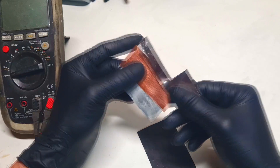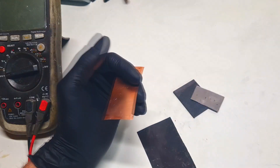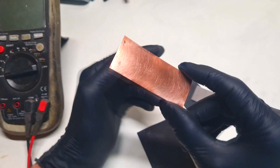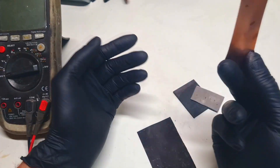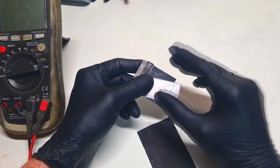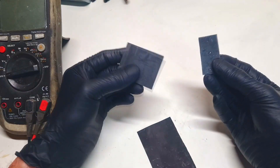Because if your battery uses a strong acid, like sulfuric acid for example, then you will not put copper or aluminum-based current collectors, because the electrolyte will eat away the current collector. So in case your battery uses a strong electrolyte, I recommend using carbon-based current collectors.